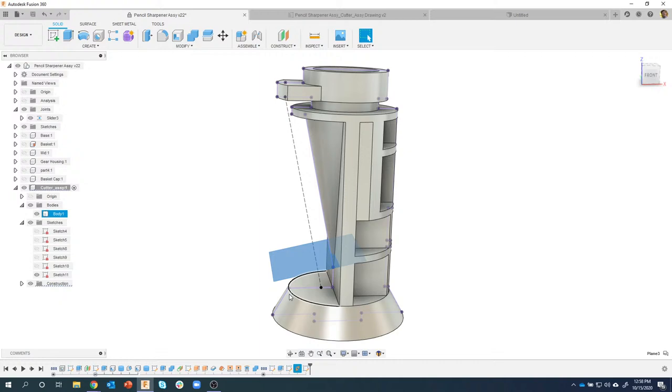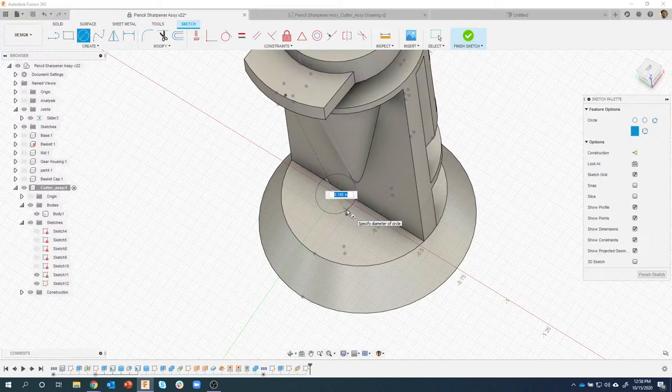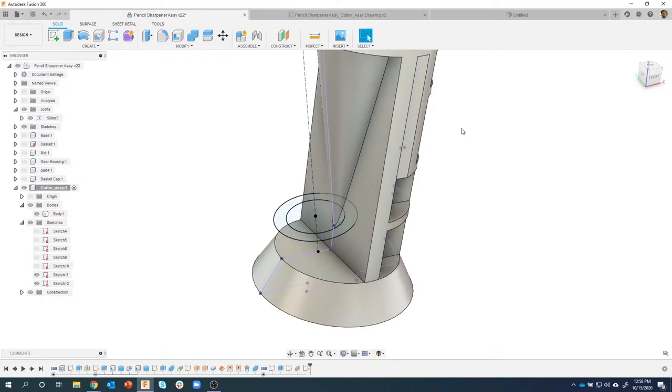We'll say create a sketch. I'm going to rotate it a little bit isometric so we can see what's going on here. C for circle. I'll click that 0, 0 point right there. I'm going to do a half inch circle, and I'm going to do a 0.35 circle at the same time. I'm actually going to save some time here, and we're going to use one of these circles to remove some geometry, and we're going to use the other circle to define some geometry. Okay, so let's grab both these guys,